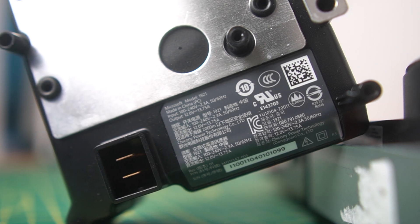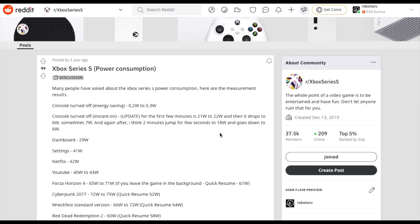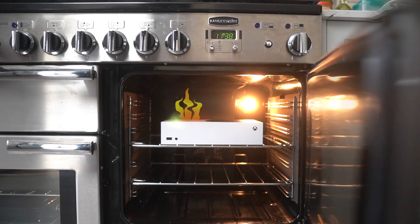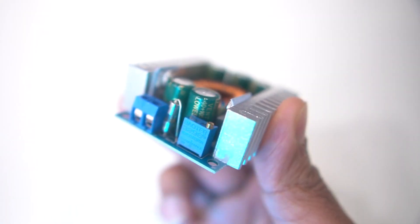But how much voltage do we actually need? I'm going with 20 volts. Here's the thing with these high-output power banks: you're only going to get that full 100 watts if your device asks to charge at 20 volts. That works out to about 5 amps of current — remember that number, we'll worry about it later. Although the original Xbox power supply can pump out 165 watts, it seems that 60 to 80 watts is probably enough to play all your games. But we've got too much voltage — we need to reduce that while keeping the current maxed out.